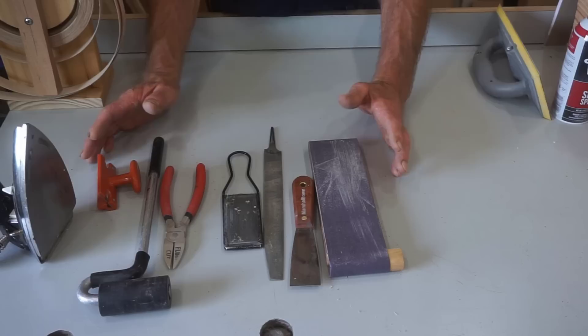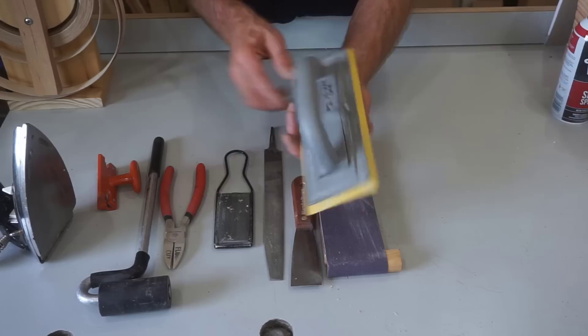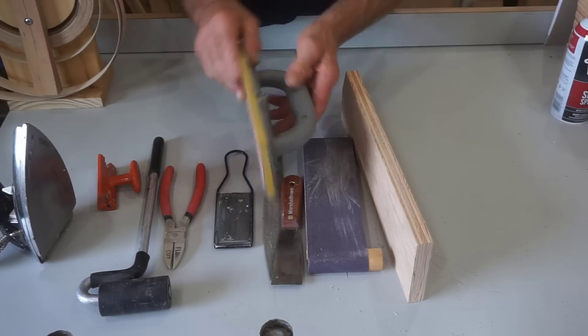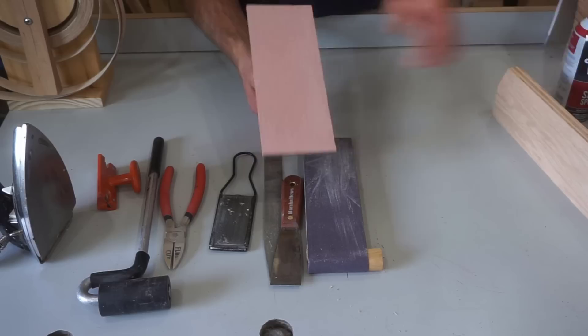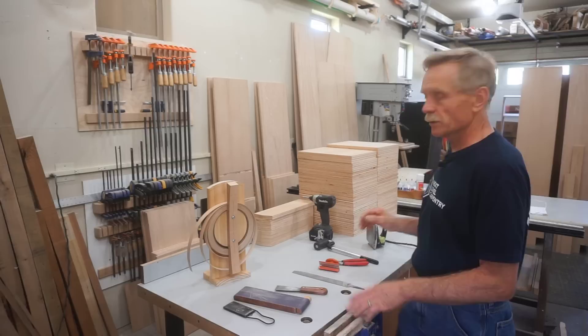So all the tools I have so far I use on either the plastic melamine edge banding or the wood. At this point I add one more tool — this big cushy sanding block. This can be used right at the end for giving the edge banding itself just a little bit of texture so stain will take to it. But obviously I wouldn't want to use that on the melamine edge banding because it would just scratch it. One distinguishing factor: I do not use this block for the initial cleanup of the edge banding edges — it's not the right type of tool for cutting them clean and smooth. That should cover the tools and overview of the edge banding process.